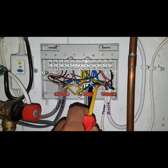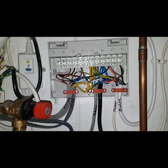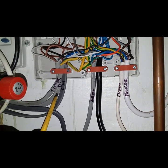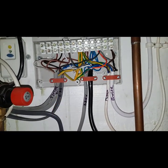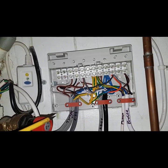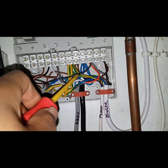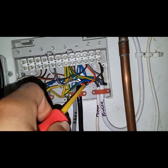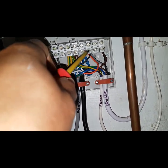So that's the area of main concern wires. Going back to what I taught in the classroom about the basics of this wiring — we've identified the cylinder stat wire there, which is good because it's been labelled. On the cylinder stat you've got one terminal, common, and then one. When it switches to one, it goes to the same terminal as the orange. So when the heating's off, that orange will be cut because that's coming from the mid-position valve. On hot water only, this will be energised to bring on the pump and boiler.